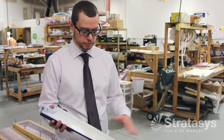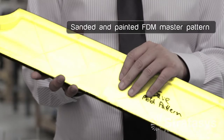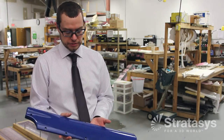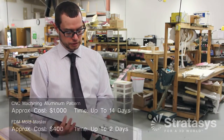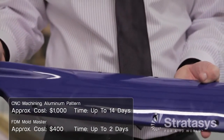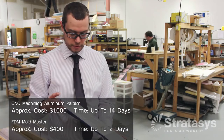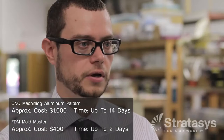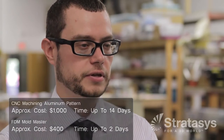This was the mold master. We printed it in two pieces and epoxied it together. It was sanded smooth on top and then we apply a clear coat. If we were to machine this, it would have to be cut from a solid chunk of wood, plastic, or metal. The amount of time it would take on the CNC for a part like this, depending on tool size, would probably be anywhere from two to three days to over a week. Now we're able to hit print and get the part even the next day.